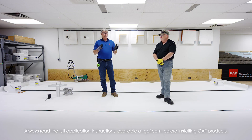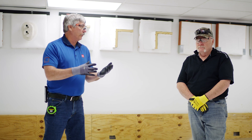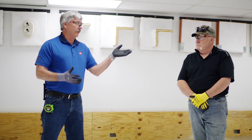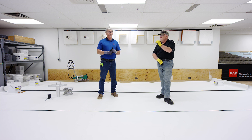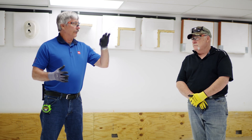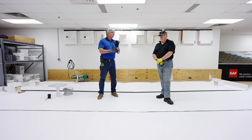There are certain things you need to consider when you're dealing with fleece in a drain. If it's a standard smooth membrane, you just run it in the drain, clamp it off and you're done. But what do we have on the backside of fleece? The fuzzies. So we can't take that fleece and go into the drain area and clamp it down, because you put water block in there, it's not going to seal correctly.